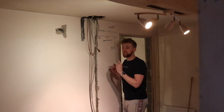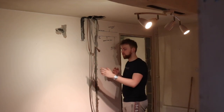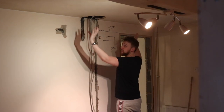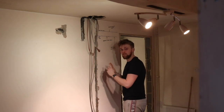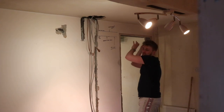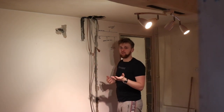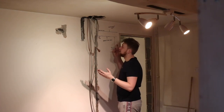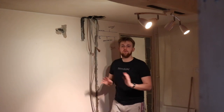To throw an even bigger curveball into the works: most people on a proper ceiling settle for a nib, which is like a little pillar built off the wall by however much you need to rest the beam on — in this case 200mm. But because I want a flush wall finish, we're actually tying the steel into the gables. The steel is going to be longer than the room length so we can't get it in and then lift it. We're going to have to smash a hole through the outside wall and slide a 5.6-metre length of steel through the house that weighs 250kg. It's going to require a lot of manpower. I could have settled for a nib but it just won't work with the way the kitchen is going to come together, and I want to follow the vision and make sure everything goes to plan.